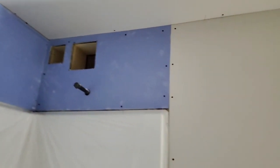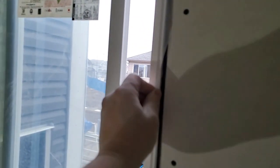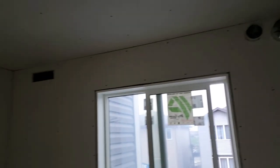So the bathrooms here, there's a drop ceiling in these, so we've got to make sure there's the blue boards up there. They want that for their tile finish up there. But yeah, I'm just checking the ceiling and the bottoms, you always miss the bottoms and tops, so that's where you've got to check, make sure there's no studs missed. All of our windows were pre-cut, because you don't want to break the poly, so you can't put the sheet on and router them out anymore, so you now have to pre-cut everything, which is okay.